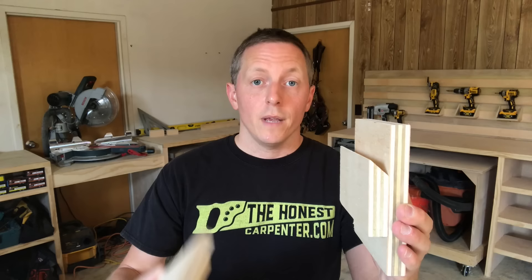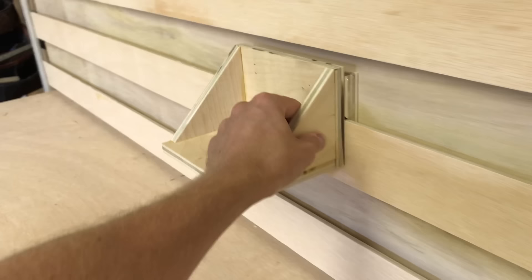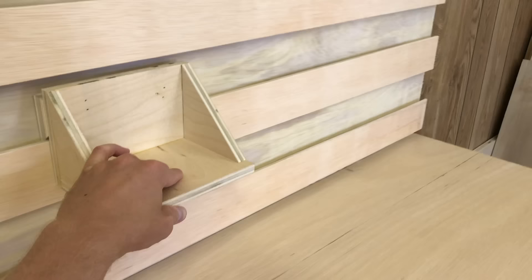The French cleat acts as the bottom rail, and the reverse cleat on the mounted object acts as the top rail. So you can just slide your object over or remove it altogether. But now you have unlimited freedom to move that mounted object as far as the cleat extends horizontally.